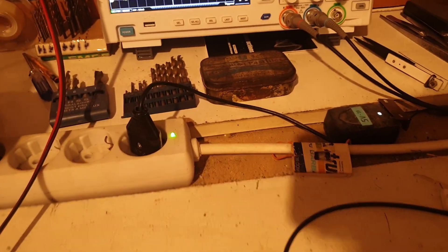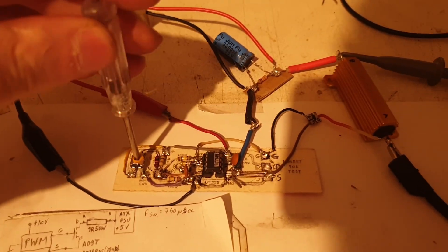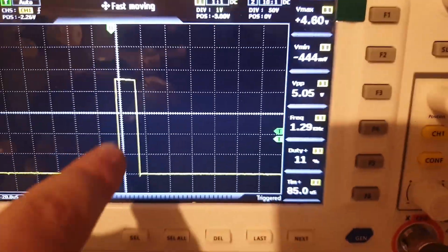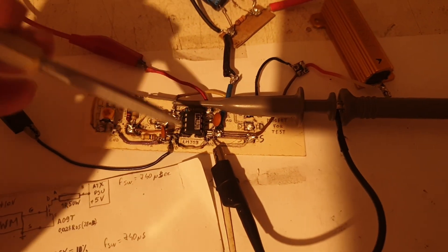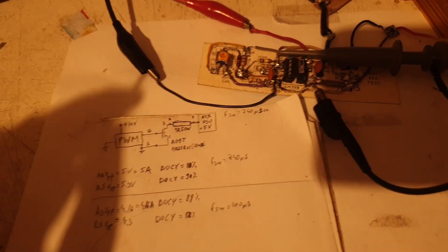Let me demonstrate it clearly: at this potentiometer position, the A-B points should show 10% duty cycle — and there it is, 10 or 11%. The square wave is quite spiky. On A-B it's exactly 10%, and I'll have the exact same 10% at the PWM output to the gate. Now I'll change the probes to the output and negative rail — and voila, exactly the same duty cycle. The duty cycle over the load resistor matches the output to the gate, while the transistor itself shows the inverse. This inversion is something to remember for future experiments.